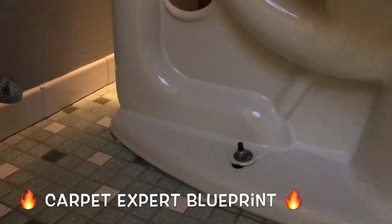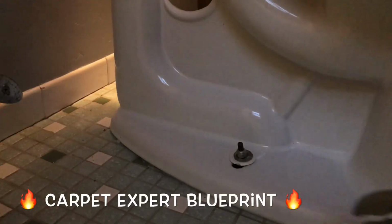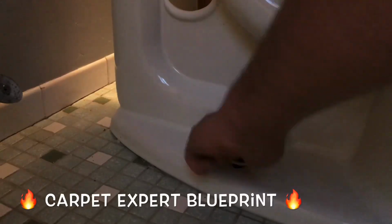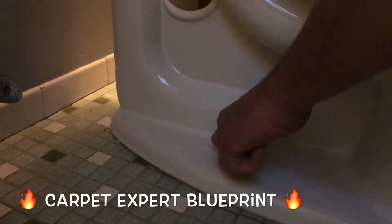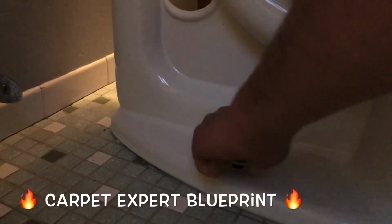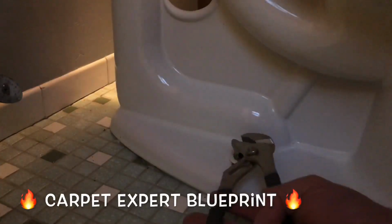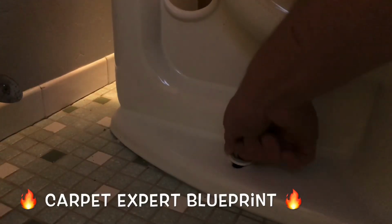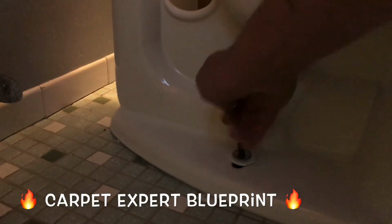But while I got your attention, let's go ahead and pull a toilet here and tell you all about the fun I had with this the other day. So for those of you out there that don't know how to pull a toilet, first things first, you go ahead and loosen the bolts on the floor, get those off and out of the way, twist a wrench and some manhandling power, twist the nut off, good to go. Loosen it up a little more, there we go. Gonna get that off the rest of the way.